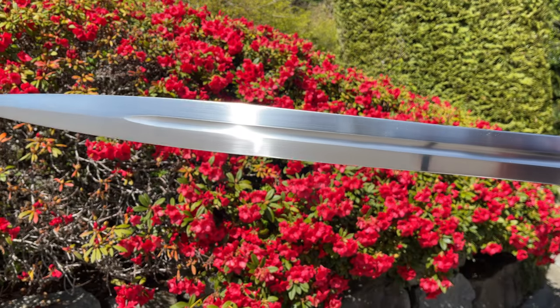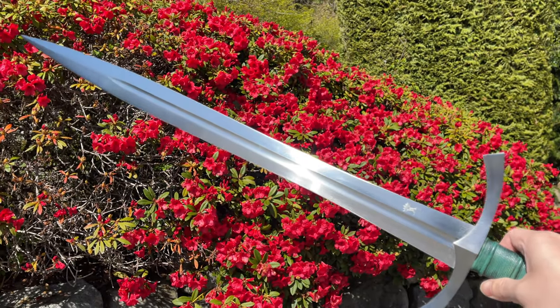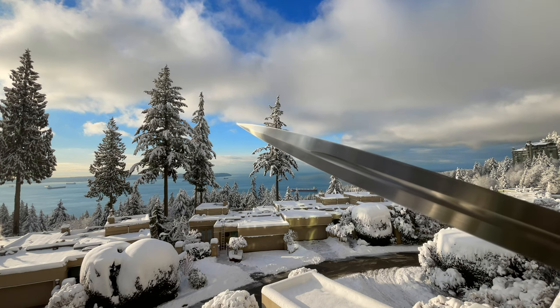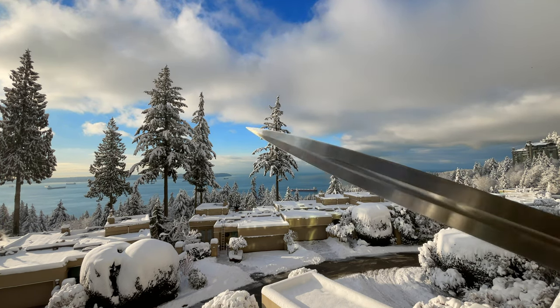The blade has a narrow fuller running 2/3 of the blade length, terminating right at the point of percussion. The entirety of the blade has a diamond cross section. Past the fuller, there's a prominent and crisp central ridge, making it very rigid.